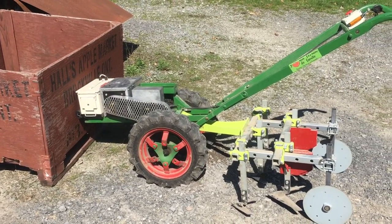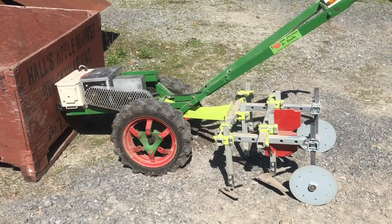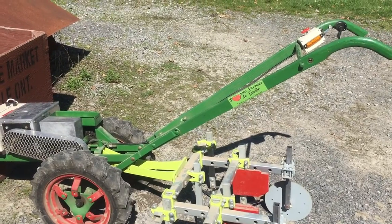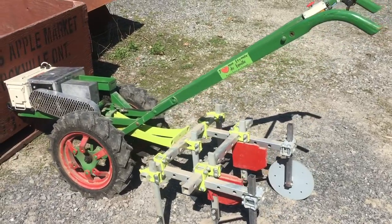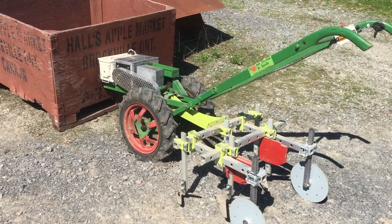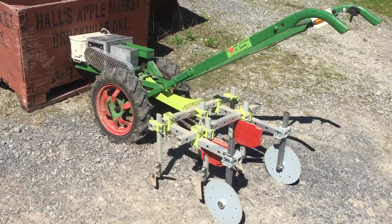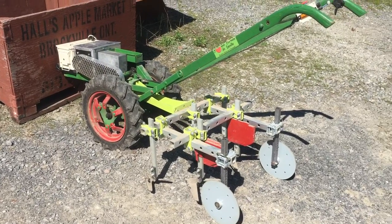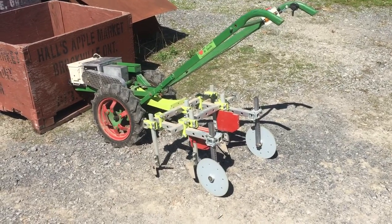It occurs to me that the scrubber motor might be current-limited because of the absence of adequate cooling air — it doesn't spin fast and therefore it can't cool itself. I wonder if a gear motor would be a better solution after all, even though you get the noise of the gear reduction. Anyway, I have one on the shelf if this one melts or something. So far this is looking promising, and it's not really the beginning of the farming season, not the time to break things that are working. Thanks for watching.